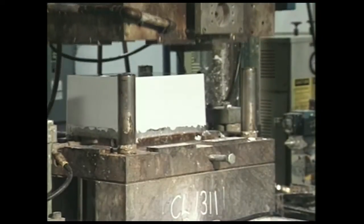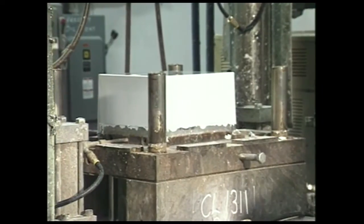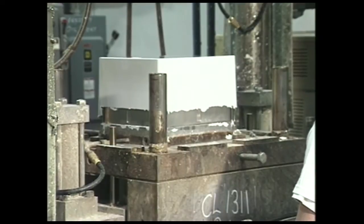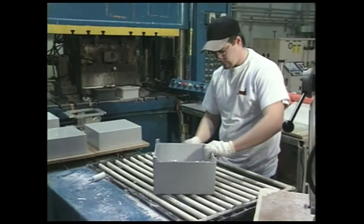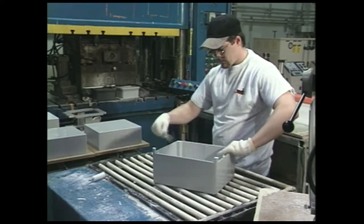The amount of material designed into the charge is in excess of the amount needed to produce one shape. This results in extraneous material called flash, which indicates that sufficient material was available to fill the complete mold through the time cycle. Flash is quickly and easily trimmed away from the edges of the new molded product, and the enclosure is now available for several other post-mold modifications.